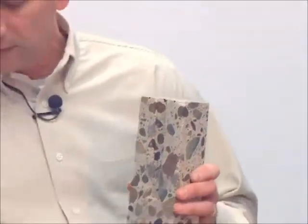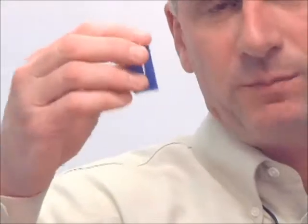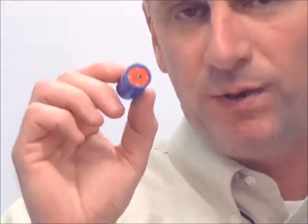The RapidRH uses what we call a smart sensor — I'll refer to it as a barrel. It looks like a little miniature barrel, about three-quarters inch diameter and about an inch and a half long. This is a patented design where the actual sensor is embedded in the bottom side of the barrel. When you insert one of the RapidRH stay-in-place sensors into a hole, you insert it all the way to the bottom. So no matter what depth — whether it's an inch and three-quarter hole or a four-inch deep hole — you're only reading at that depth.